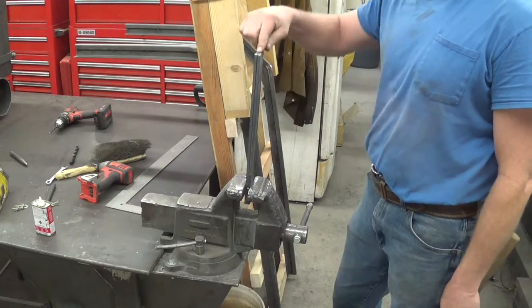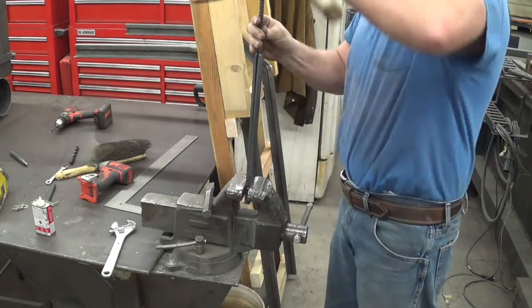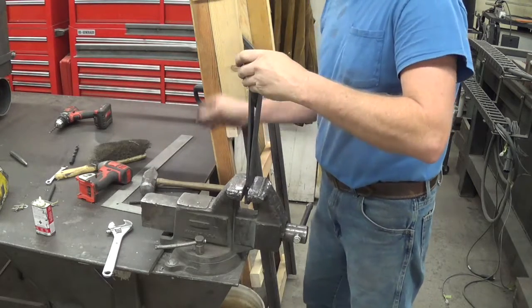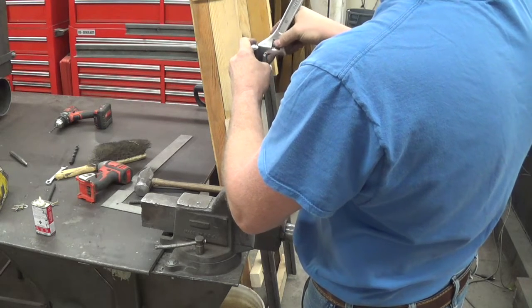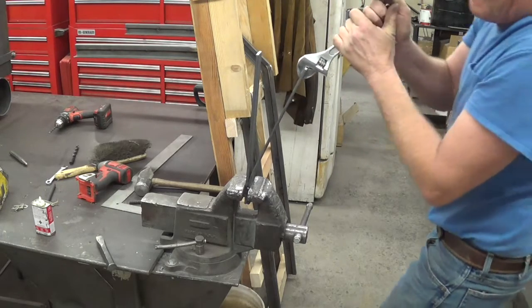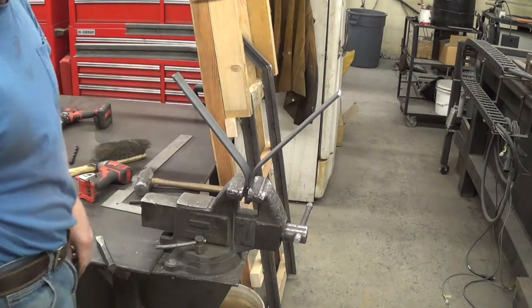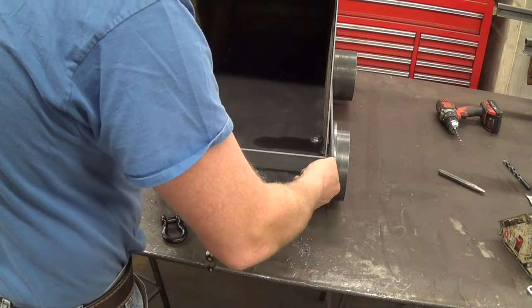Using my bionic eyeball I've got that straight up and down. I'll get a chisel in here to get that started — here's a homemade chisel I made out of a piece of rebar. I don't even need to pry it. I'll get a presser adjusted up on it, put a lever, and see if I can bend it. A little bit more. Looks like it's going to work perfect. Then I'll be able to weld that right in there — I may even have to narrow it up a skosh just so it fits better, but that's going to work good.